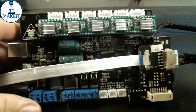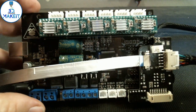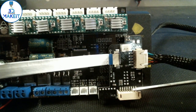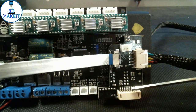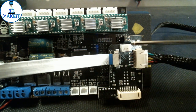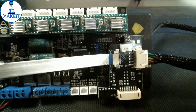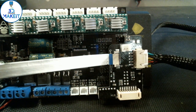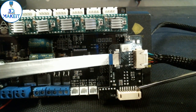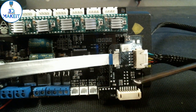I just wanted to take the opportunity to try some new things. We have the hub which goes to the leveling sensor — that's removable — the end stop, the hot end, thermistor, and separate wiring that goes through to your stepper motor. All of this wiring had to be figured out in order to put another board in.